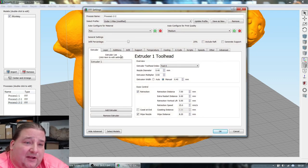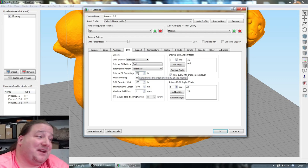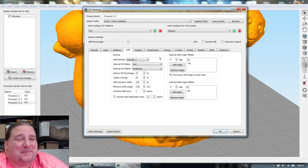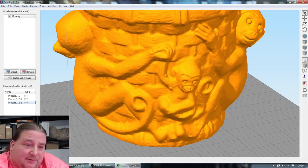On the third section I jump infill back to 25%. The first couple of layers in that section will have some missing bits, but by the time it reaches the actual top layers there will be a solid bed of 25% infill underneath, giving you that nice pretty top layer. If you try to print a nice top layer with only 5% infill, you'll probably still get bubbles. You really need support — and your infill is that support.